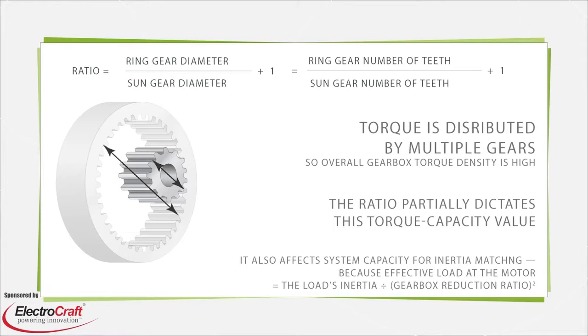The tight tolerances and low backlash of planetary gearboxes, along with high torsional stiffness, help to minimize backlash and boost the precision of the gear motor assembly, which is particularly useful in applications where the setup is driving a positioning task.